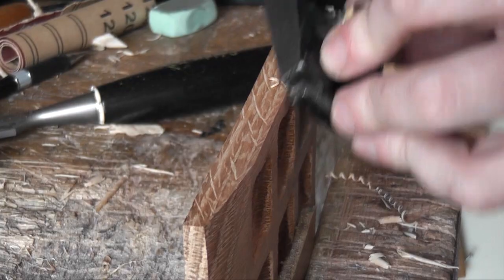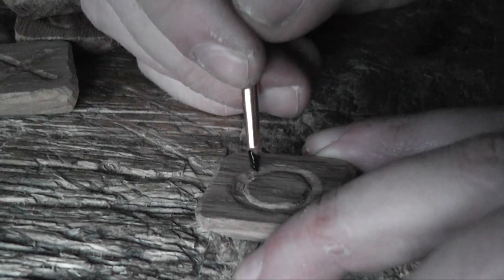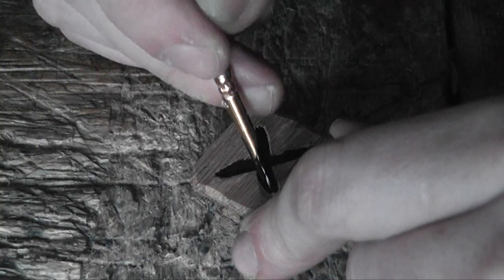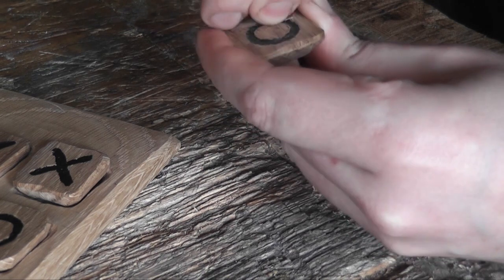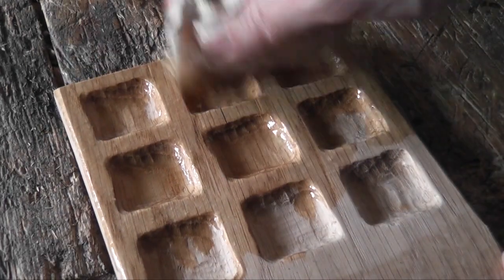I used my plane to make a little sloped edge on the front. I was thinking I might carve some initials or something on that at a later date — we'll see. Then I simply painted inside the pieces I carved away, inside the noughts and the crosses, and used a bit of sandpaper to get down in the gaps to take a bit of the paint off, so you could see the carve marks and it looked kind of worn. It's a cool little look. Then I slapped on as much Danish oil as I could, as hurriedly as possible, to get it done in one fairly quick take for the camera.